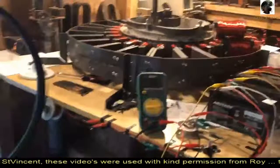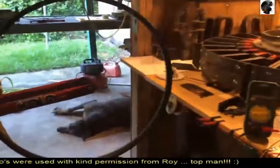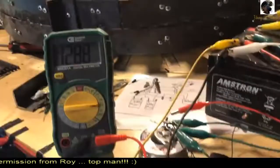It took me several days, 3 days, a few hours a day, 3-4 hours a day to problem solve this. And so far, it came down to changing the resistor and changing the coil windings and the coil size. Now I'm going to dig into it deeper. So I tried to put that off of there, it wouldn't work. So I'm going to build another circuit just for this side to have two sides running.